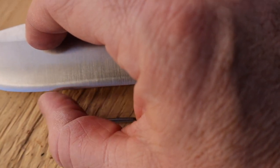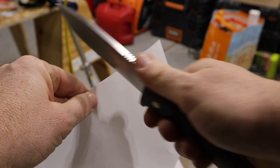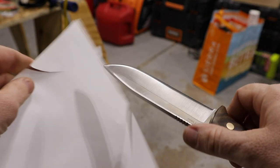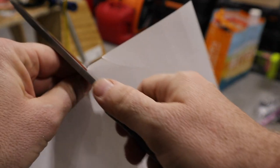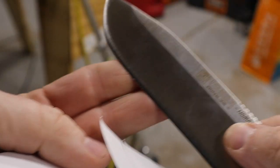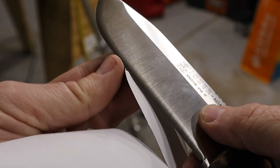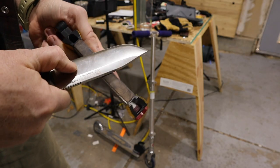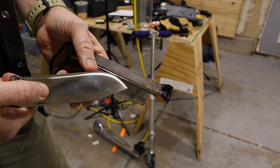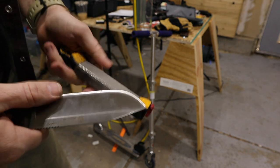I've rolled it — I can definitely feel it. The sun is getting really harsh but there you go, we can feel it. It's actually still performing pretty well, but you can see a little bit of that burring — hopefully you guys are going to be able to pick up on that. You can see where it's snagging, where I've damaged the edge. A strop alone is not going to take out that damage, and I can't just start going on the stone itself.